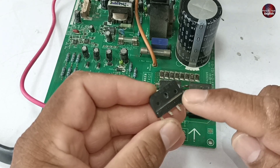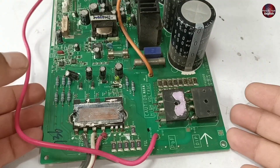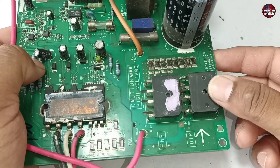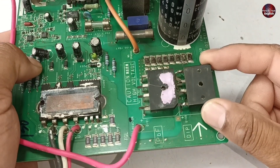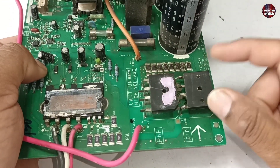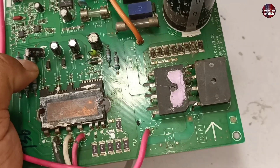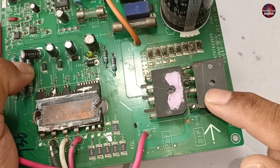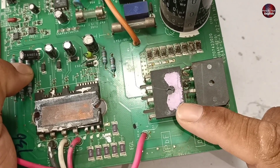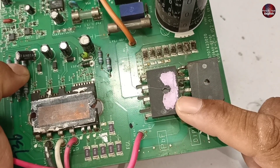If you are still willing to install a bridge rectifier in parallel to increase capacity, use the same rectifier as the one installed in the motherboard. Keep in mind its batch number, capacity, and manufacturing company should be the same — then they will work fine. If the voltage drop of the rectifiers differs by manufacturing company, they could still cause problems. Always be careful doing this kind of modification.